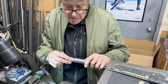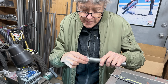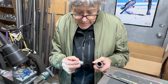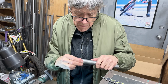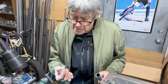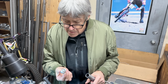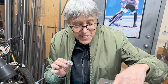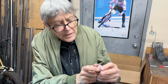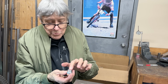If it fits in there. Oh, and it's a little bit sloppy, which is what I want, because this is going to get welded on. This is going to distort from the welding. Okay, so need to take off that little guy there. Oh, the thread didn't quite go all the way through. So I got to run the tap through that again. So we'll just go over to the drill press, use the countersink, get these holes down a little bit.